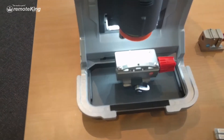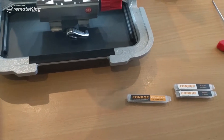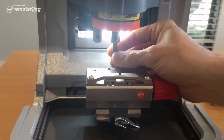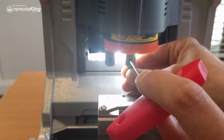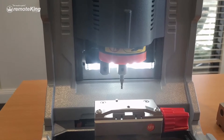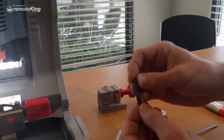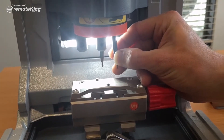Now you want to get a cutter and a probe. For this purpose we're going to use the 2.5mm cutter and your standard probe. Get your cutter out of the packaging and install it in, nice and firm. One thing to note with the cutters is they all have a channel or groove for the grub screw on the allen key to lock into. Make sure you line it up correctly and insert it far enough so the grub screw locks into the correct locking position.